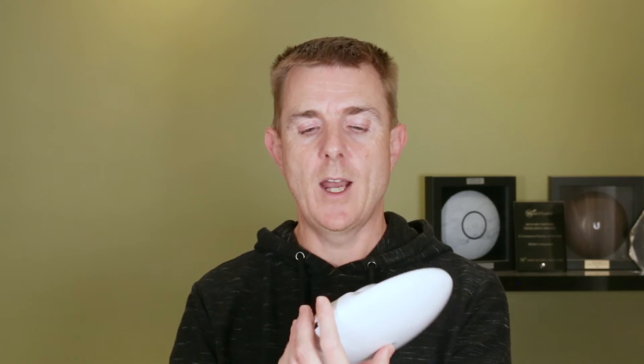We've covered what you need to create a point-to-point network: the devices, how to power them, and clear line of sight. There are instructions on our YouTube channel — a video on how to configure the operating system in these devices to create your point-to-point. Once you've created your point-to-point, you've basically extended your connectivity from your main property out to a remote location. At that remote end, maybe it's just for a camera — it might connect to a nano switch or flex switch. What you've created is just like an ethernet cable. If you've got a DHCP server and router in your main property, all the IPs it gives out are now available at your remote location. You can wire using ethernet cable into your nanobeam and plug directly through the PoE injector into your camera, intercom system, or whatever it is.